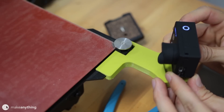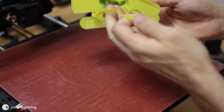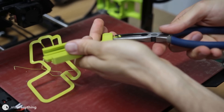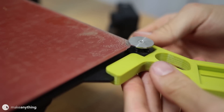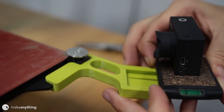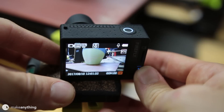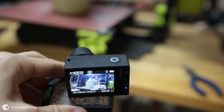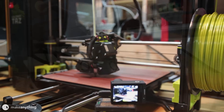Having learned from my mistakes, I went back into Fusion and modeled a second version with a few changes. I decided to use computer-generated supports instead of custom ones — they're harder to remove but give a cleaner result on the top wall of the slot. I also modeled in the cutout so it slides on correctly, increased the tolerance on the camera slot, and added a little clip on the bottom so it snaps into place. Everything fits now and it's a good angle, but for larger prints I need to back the camera away quite a bit due to the narrower 90-degree field of view. To deal with this I'll print an extension arm for those larger parts.